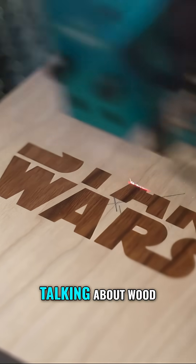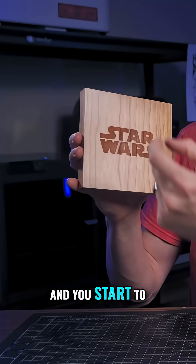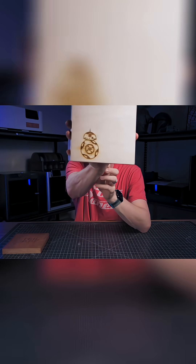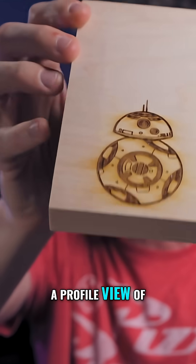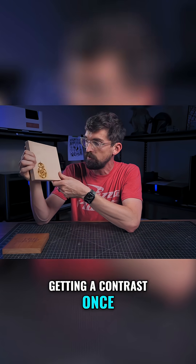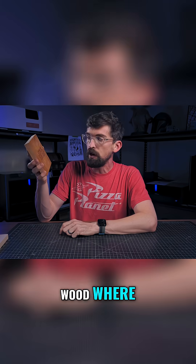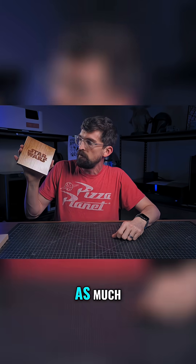Especially when talking about wood, if you engrave at higher power and start to get more and more depth, it may give you an effect you don't actually want. This piece is going in about a 16th of an inch — you can see that in a profile view. In this case it is maple, so you still get contrast once it goes in, but especially if this is a cutting board or a surface someone is going to use, you're still going to be able to feel those indents in the wood. With less power but higher speed, you're really not going to see that effect as much.